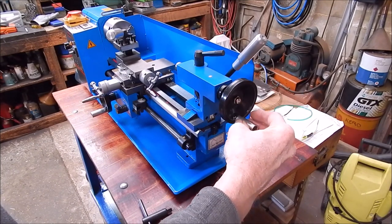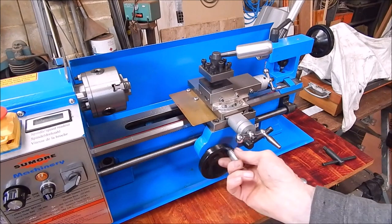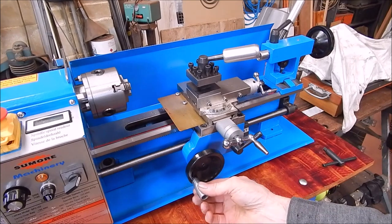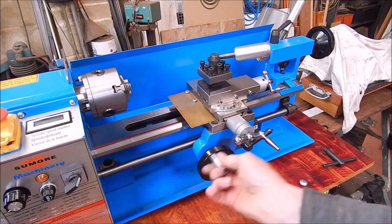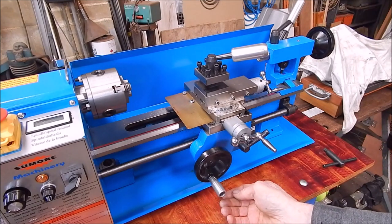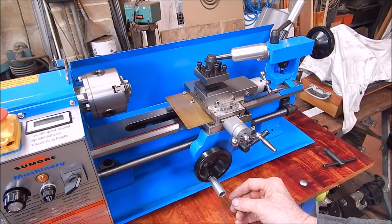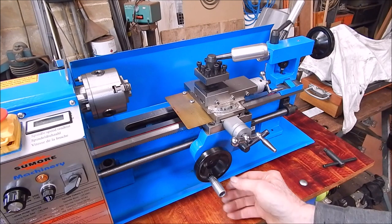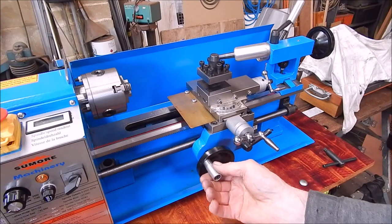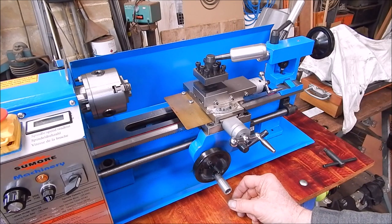And this one down here as well. I reckon that's a good mod — there's no actual slop at all now and it's nice and snug. This shows you what you can do with a bit of home cast aluminium. Collets are definitely a big advantage to do this sort of work, and you can avoid marking stuff, particularly when you're working on soft metals like this. Well, that's it for me — I hope you enjoyed it. We'll see you next time. Cheers.